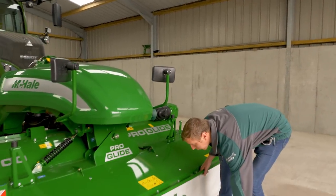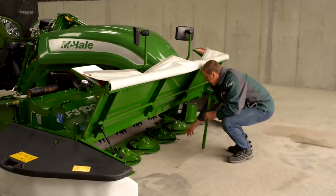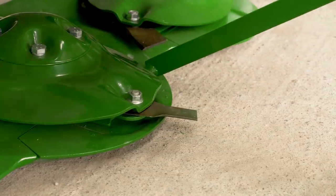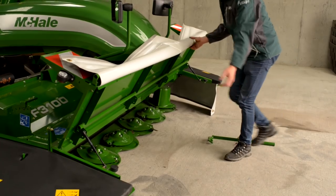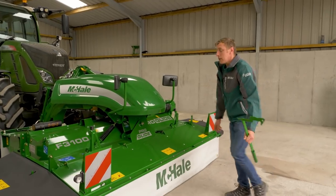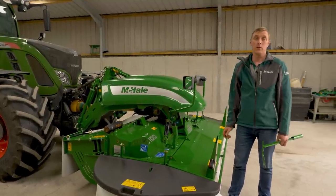This lever is also used for removing blades or knives from the cutter bar. Fold up the front safety guard and curtain so you can see clearly. Here is the bed of the mower with the blades on each disc — with the blade pointing forward and the disc perfectly forward, put the lever behind the blade and push down to easily remove it and replace with new blades. The last adjustment is the conditioner baffle plate — a lever on the front side lets you adjust it up and down to condition different crops as required.